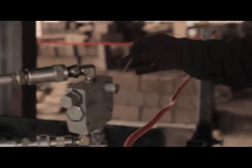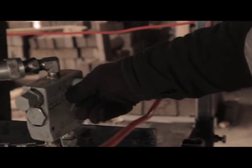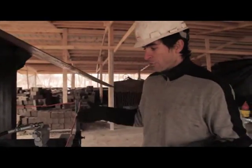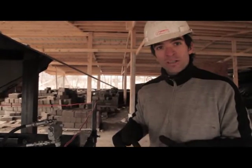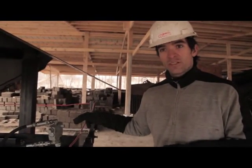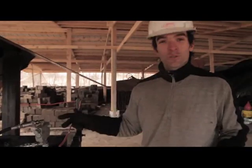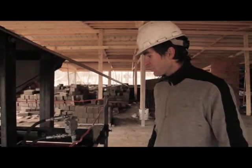To set the flow control valve, take some kind of a handle and twist it to select the flow. Adjust it up and down as needed to make the secondary cylinder go at the rate that you need based on the particular power unit you're using. For lower power — like 5, 10, or 20 horsepower — you probably don't need to slow down the cylinder; you want it to move as fast as possible. At 50 horsepower, you definitely want to slow it down, because otherwise it would be shooting in and out like a bullet and causing unnecessary stress.